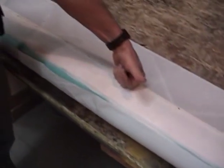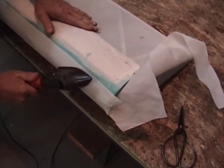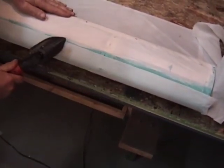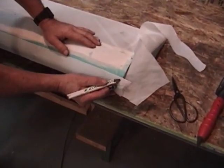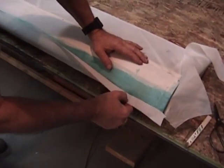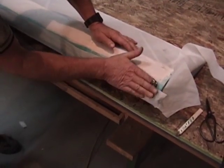Also, let's say your fabric was too long. What you could do — and it works very well — is at this stage, take your iron and make a nice heat pass right along the nose here. Take some pressure and heat, because that leading edge is really wicking the heat out of the iron. Then you can take a pencil and mark your fabric wherever you want to cut it, peel it back — it's stuck fairly aggressively where we ran the iron — and then you've got your reference mark. Take your shears, cut it off, and once it's cut, go ahead and lay it back in.